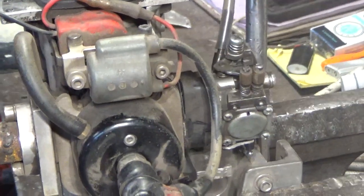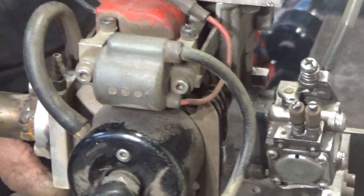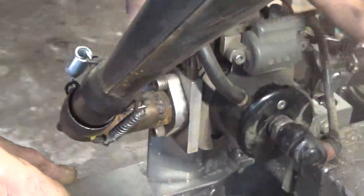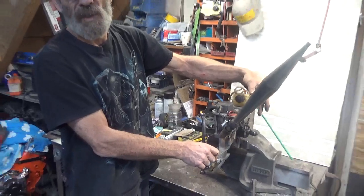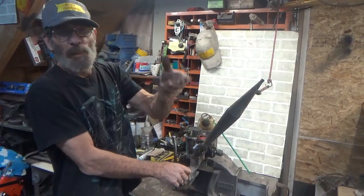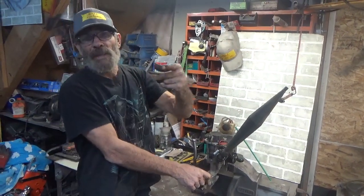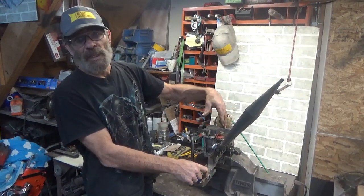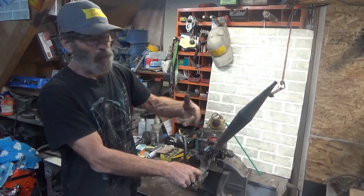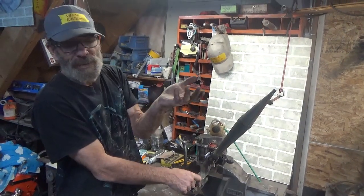And the reason for that is because when I first built my tunnel hull boats and I had the motor with the spark plug sticking back, everybody runs into that problem of the carburetor getting snuffed by water coming off of the rear sponsons of the tunnel hull. So you've got to design a special breather apparatus to cover up your carburetor. And I thought, well, why not do it like the real F1 tunnel boats and have ducting that feeds air to the carburetor straight from the tunnel boat itself.